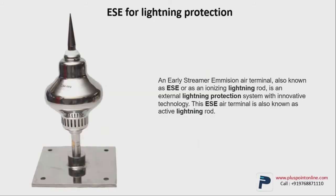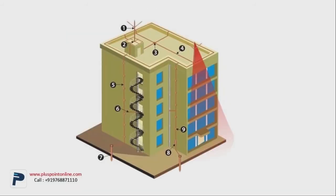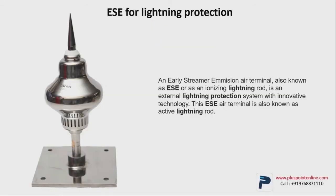The latest technology is the ESE lightning protection system. ESE is also known as an ionizing lightning rod and an active lightning rod. The lightning protection system is developed as per the modern technology. You must have seen that in the copper rod system, multiple copper rods are attached on the roof of the building. But with this modern and innovative technology, with just one rod the work can be completed. There's a small circuit in the rod — one part is facing the ground and the other is facing the top. As the weather gets worse, it gets charged, and once the lightning strikes, it gets discharged and transfers the entire energy into the ground.